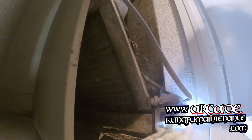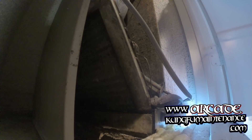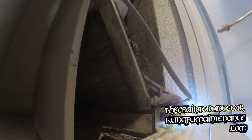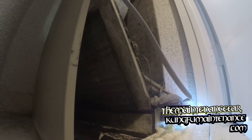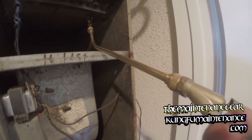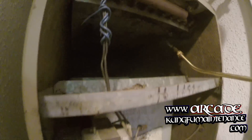You may need to turn the unit off when you spray that one. I'll need to wait five minutes for the pressures to equalize before turning it back on, but that'll just allow me to spray it really good and spray the coil up top as well. That's how the hydronic unit is.